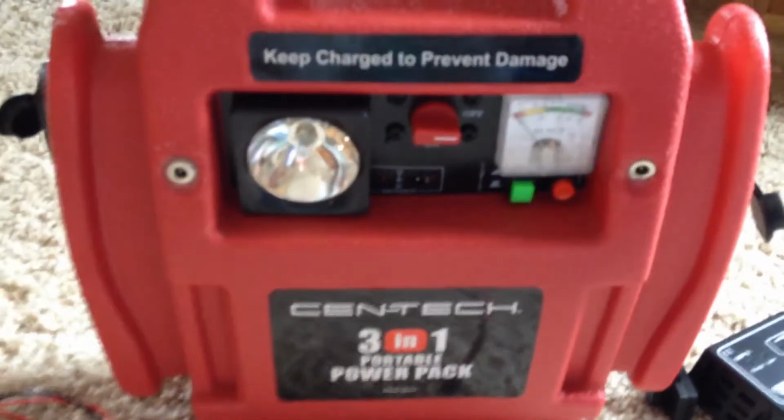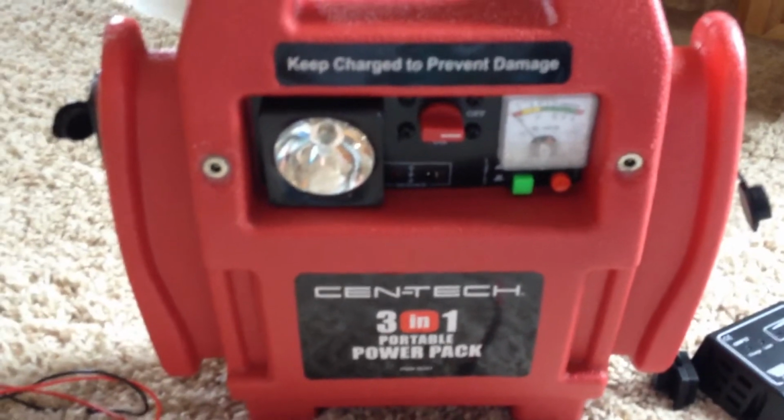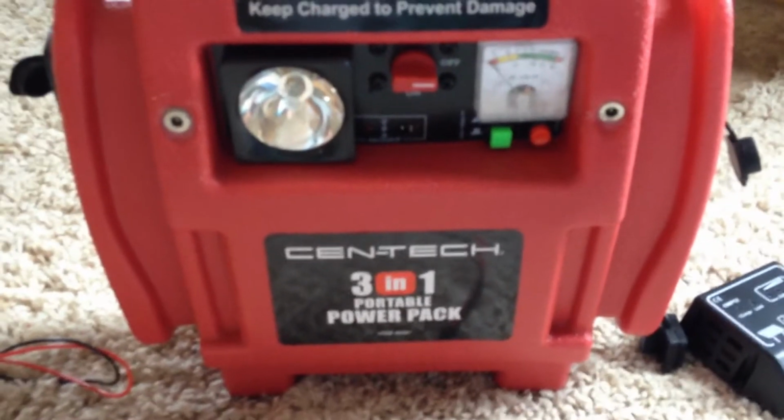1.19 amps. So if you took 10 amps, which is the capacity of the power pack, and divided it by 1.19, you could put about 8 of these panels on, which would be a little overkill, but that's what it would be. To be safe, I would figure the most you'd ever want to put on this would be 120 watts of solar panel power, because 12 volts times 10 amps equals 120 watts.